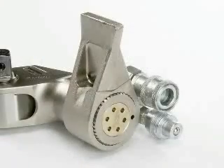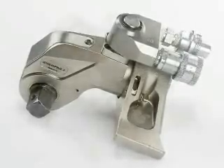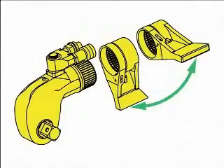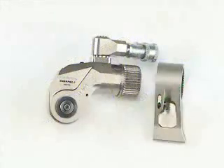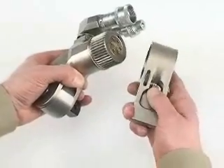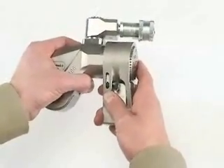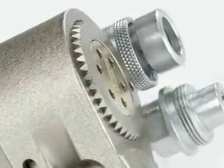To mount the reaction arm. Because of the rigid steel design of the S-Wrench, the reaction arm can be rotated incrementally around the tool with maximum torque limited to the range shown. This will maintain stability against a reaction point up to full torque. Position the reaction arm onto the ratchet end of the tool. Press the latch and slide the arm all the way onto the tool. Release the latch to secure the arm. Approximately one-eighth inch of the splined end of the wrench should be visible on the outside of the reaction arm.